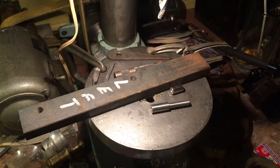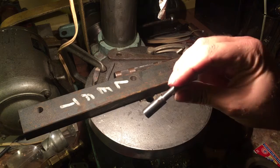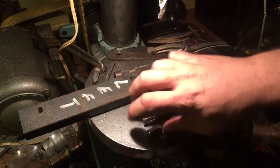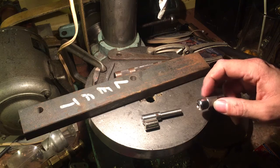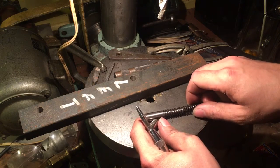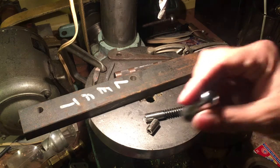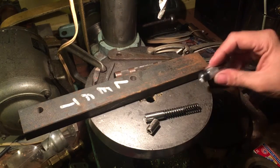We'll unscrew that — here's the new hammer. I just made that out of a little piece of drill rod, pretty simple little part to make. It's got extra mass: it's longer, about an extra quarter inch on the body, and it's also got this extension which acts as a guide rod and rides inside the spring. It was made long enough that I drilled a little hole in the back of the cap to clear it.